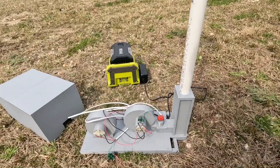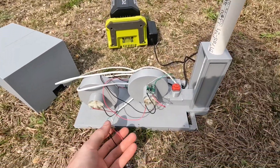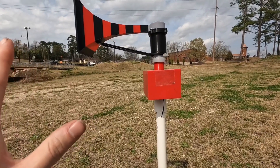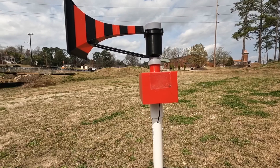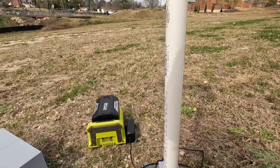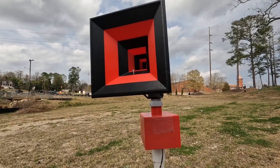I had someone who commented saying it was rotating a little fast, even though I had said literally in the same video that it didn't have a speed controller on it yet. This is that speed controller — it dictates how fast the actual projector rotates. Right now I have it set for 2 rpm, but it can go all the way up to basically 8 rpm and even a little bit faster than that — up to about 10 rpm. It's currently hooked up to just USB since this is my own model, but it won't be that way in the final.